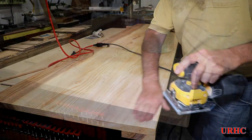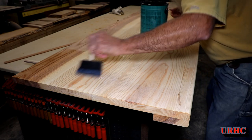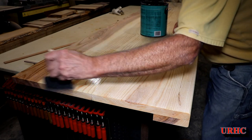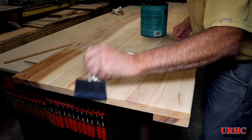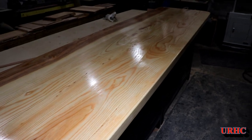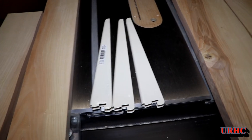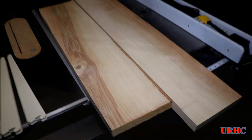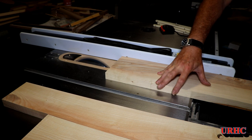You can see it's starting to come out pretty nice now. When you do a slab like this, you want to make sure that whatever you do to the top side, you do the exact same thing to the bottom side, so you don't have a problem later. There it is all finally coated up, and I had some more pieces that I had prepped at the same time for brackets to hold the desk up and the legs and stuff.